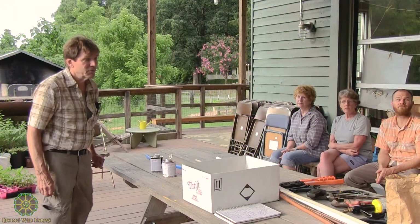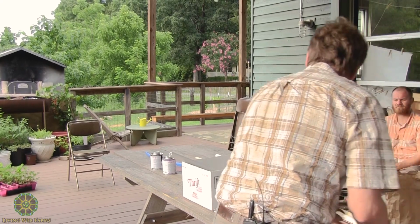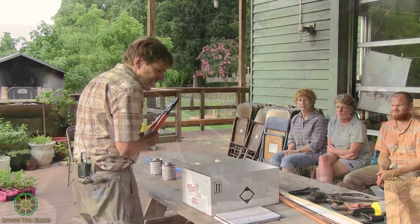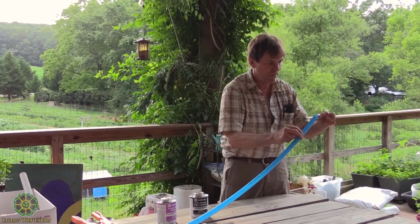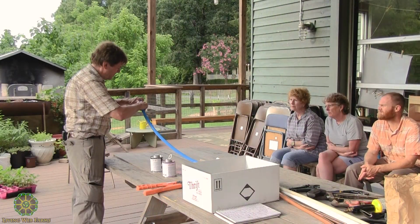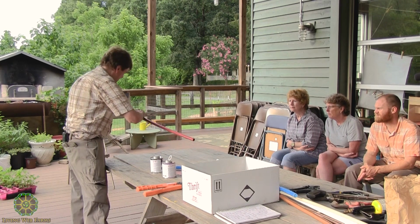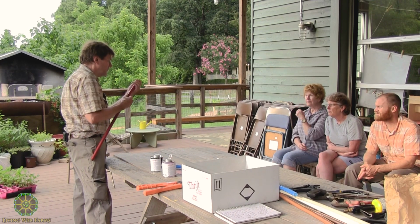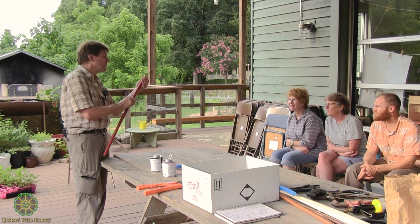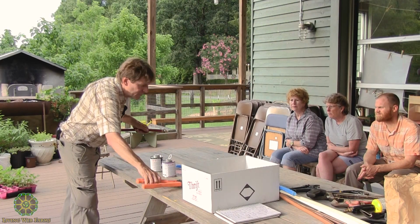The only other thing with PEX that you might even think about is the tool that's used to make the clamp. We have the pipe we want to fix, and the clamp that goes over it. Well, there's a burr on that side. Let me get one that's not. It's been cut clean. These have to be cut clean, or else you waste time trying to sand that down. So the little clamp goes over there, that goes in there like that, and then you take this tool.